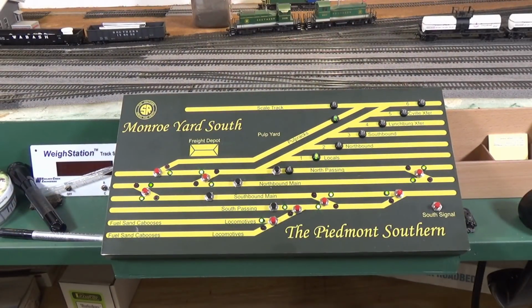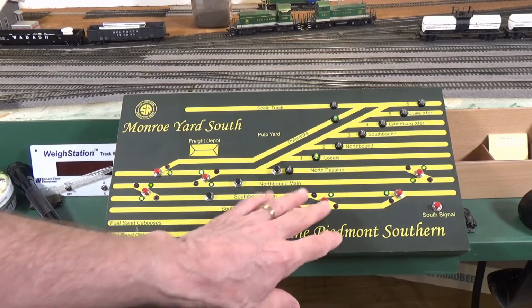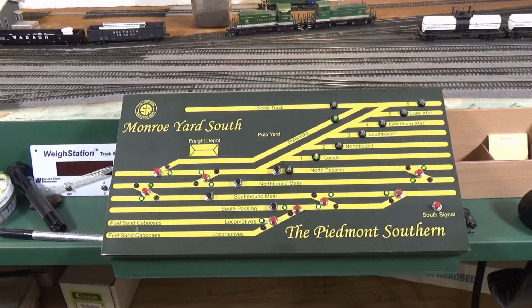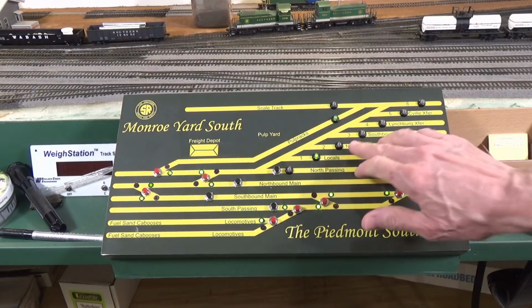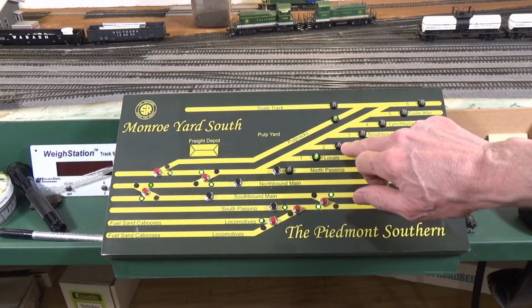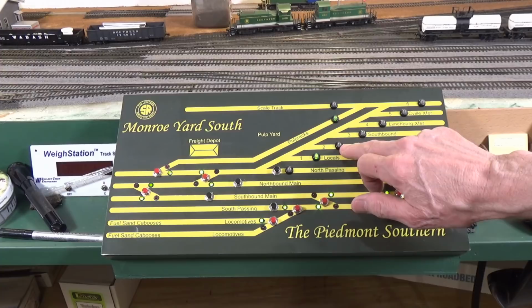So let's go ahead, and I'll talk some more about this as we go through this little project. One of the first things I want to show you is how I used that second set of switch contacts with just the 2 wires hooked up to the single pole double throw switch. Now you'll notice I've got a bunch of LEDs here, but the ones that are important in this case are these LEDs right here. Each one of these is actually a push button with an LED built in.